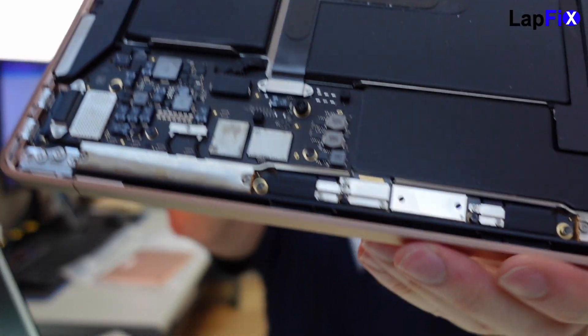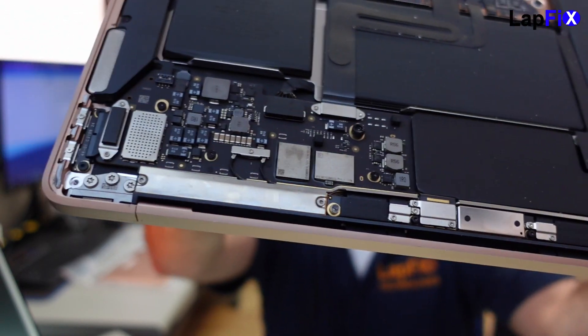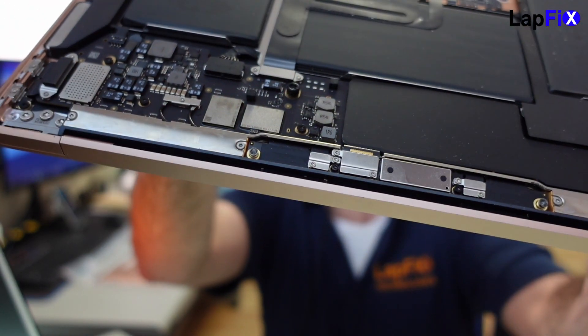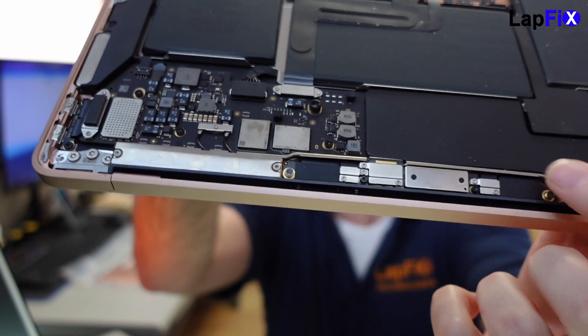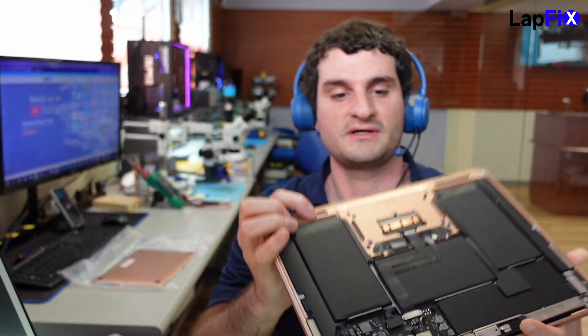There's something obvious going on here. We see that it's not getting the correct voltage and amperage — no current going through either. We need to see if that's caused by some type of damage. Since I do have it open, I see a little bit of stains. It kind of looks like there's liquid where the metal is. You can see the metal shining off the Wi-Fi connection, and there's probably some type of liquid — that's what we're expecting.